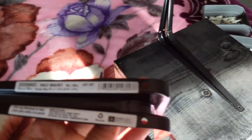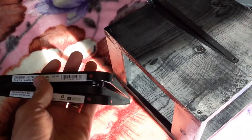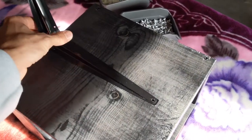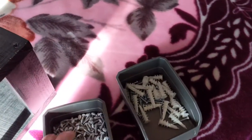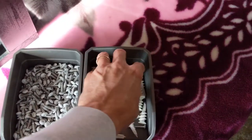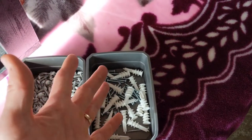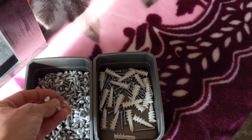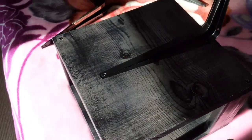What are these called? Shelf brackets - that makes sense for shelves. I got two of them. I was gonna do two but I was thinking, these things hold a hundred pounds - I'm not gonna be doing pull-ups on these things - so just one right in the center is gonna be perfect to hold this. Should be plenty. I'm gonna be anchoring the bracket into the bottom of the shelf using screws, and I love using these wall anchors because they're super burly and they work really good. I'll be using three to anchor to the wall and three to anchor to the bottom of my shelf.